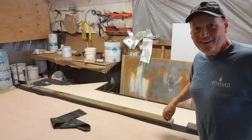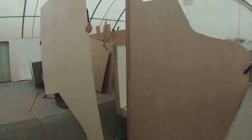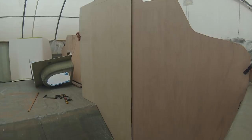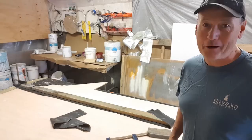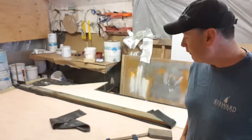Not a bad day's work, really. Next morning — I epoxied the scarf joint on this yesterday, and I'm just coming to check it. The epoxy has gone off really well. It was a pretty warm night, so always good to see a little bit of heat — it helps with the exothermic reaction, helping to force-cure it. We're heading into the high 30s this week. It's only October, so I'm a bit concerned about summer. It's going to be 38 here on Friday — 38 degrees, which I think is 100 in Fahrenheit.